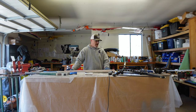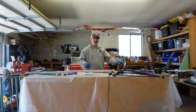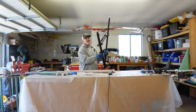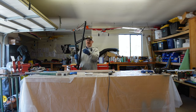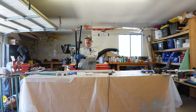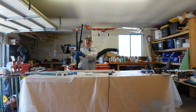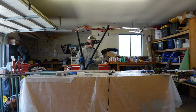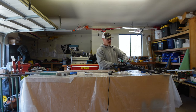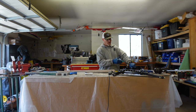If I can hide it behind the covered gear leg, that might be a little better looking. With the TK1 landing gear leg, which is what this is, the front tube is really beefy, much larger than the Kitfox gear leg, and the aft tube is actually larger as well. On the Kitfox gear leg, you can use the wing strut fairing plastic extruded stuff as your fairing on the back of the gear leg. You can't do it on this one because the diameter of the tube is larger, so I needed to make a fairing for that.